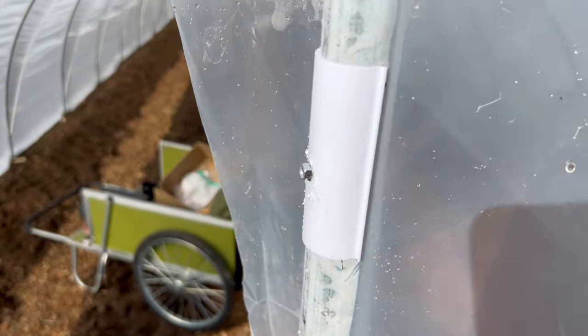Once you get the first door done, secure it open and repeat the steps on all four doors. It takes me about 30 minutes per door once everything is staged. Total time on end walls was most of a day since I had to go to Home Depot twice. I'll also share another end wall type I've built on my nursery tunnel, but I wouldn't recommend it: it's made of wood which will eventually rot, it blocks the sides of the tunnels making it difficult to use the paper pot transplanter and Jang seeder, it took twice as long to build, and it doesn't allow maximum airflow. The scissor door option is by far the easiest, cheapest, and most efficient end wall option I've come up with.